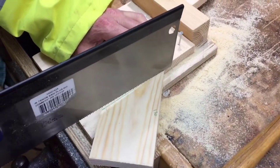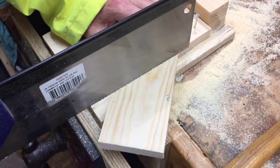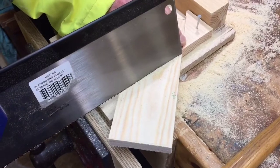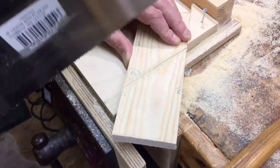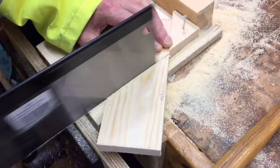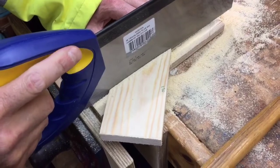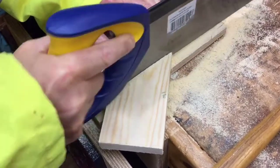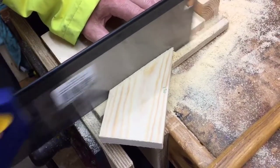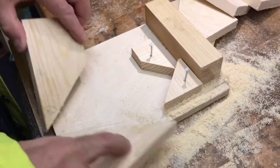You can see the 45 degrees mark at the edge. Mark it, then bring the saw blade back and narrow it as you go down. Must be dead vertical that way. Go slowly - don't go mad. Almost let the weight of the saw do the work. And what's that called? A jig.